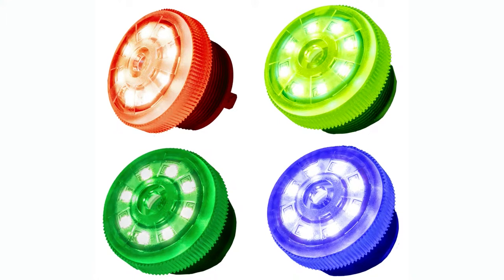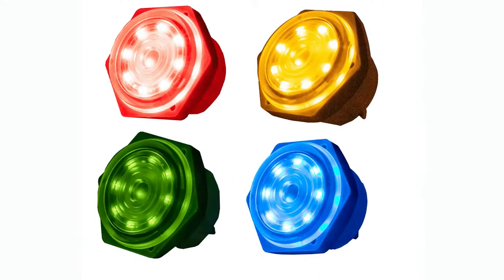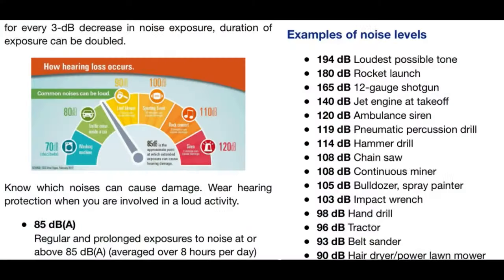Also available in red; the yellow kind of looks greenish, but it's red, yellow, green, and blue. Then there's a larger panel mount one that's flatter — not as rounded on the top — and it's bigger at 36 millimeters. So four versions, four colors, about 16 total versions available. These are pretty loud: even the PC pin one is 83 dB. The panel mount ones can go up to 100 dB at 15 volts, but even without that they're around 95 dB — hand drill or tractor noise level. They will definitely get people's attention.